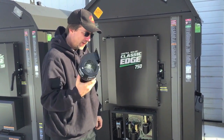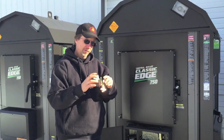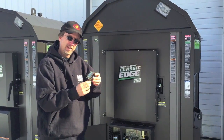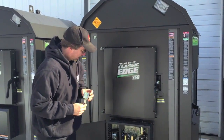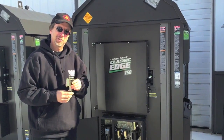On top of the fan, you have your three solenoids. The only maintenance required on these is a squirt of WD-40 on the actual plunger, and it's a good idea to do that in spring when you shut it down. These are very easy things to do, but they're important, and it'll make your investment last a whole lot longer.